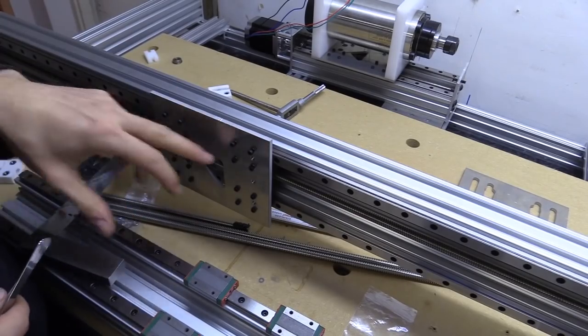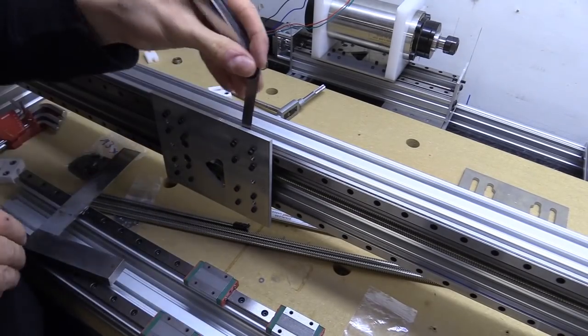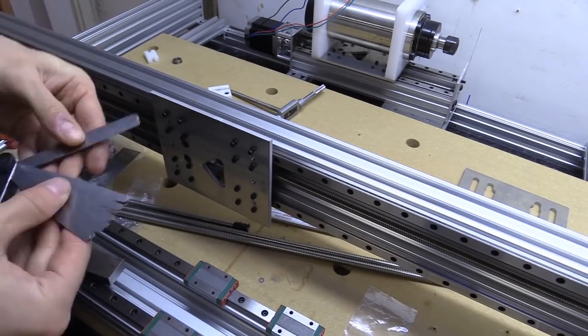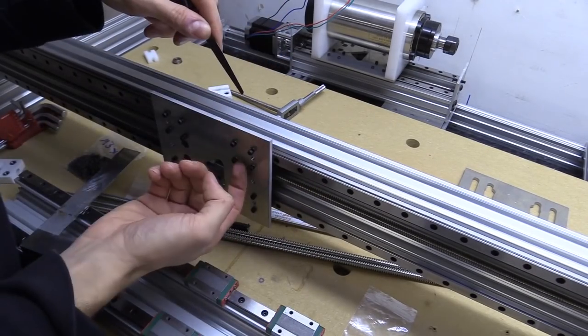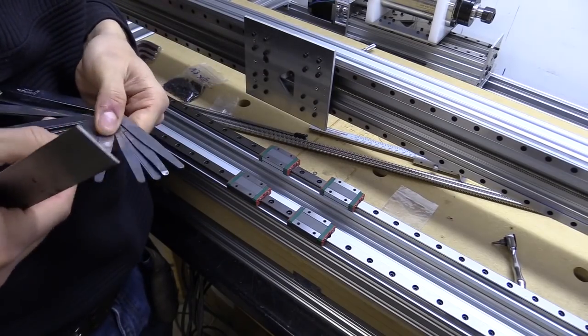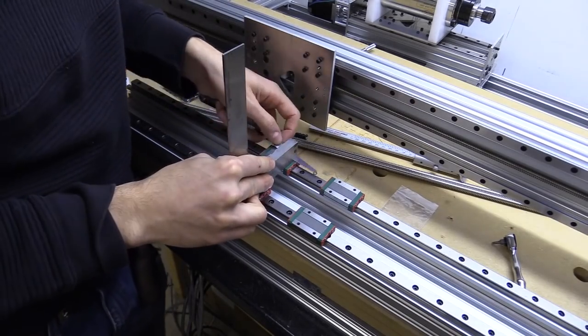What occurred to me, unfortunately after fixing at least 3 of the plates using the slotted holes, was that I should have used a different method, shims. The plate can pinch and restrict movement when tightened to twisted rail blocks. While I can still move my plates when everything is fully tightened, it's preferable to get things running as optimally as possible so there's less strain on the motor and parts.